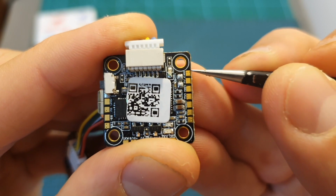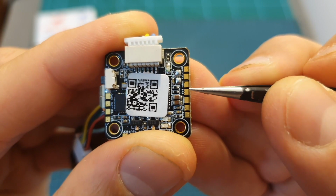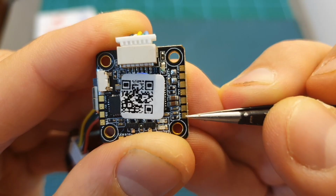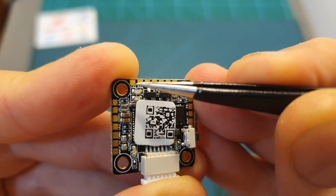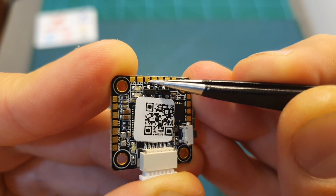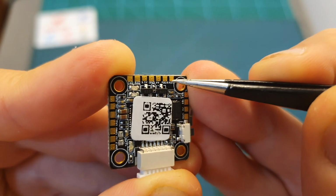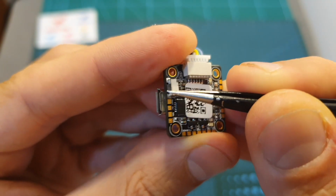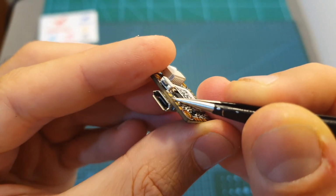So over here you can find the video in, then plus 5 volts, ground, TX1 for the smart audio feature of the VTX, ground, plus 5 volts, and video out. On the back you can find the soldering pads for connecting your receiver. So over here you can find TX2, RX2, 3.3 volts for DSMX receivers, ground, plus 5 volts, SBUS and RX1 pads. On the left side you can find pads for a buzzer and an LED unit. Over here you can find a physical boot button,